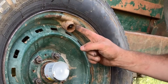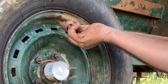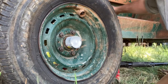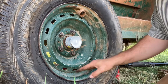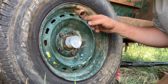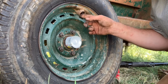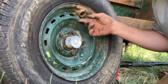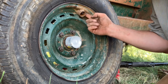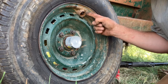You guys seeing this right here? All that is is a nipple, and the valve stem is right there. You're wondering why the valve stem is right there — well, this is something that cattle come up and eat in. They stick their head in here and eat. What they do is step on that valve stem and break it off, and you're always about 300 miles from home it seems like. This little nipple here protects that. You have to carry a screwdriver — sometimes dirt and muck and yuck get stuck in there, but not often. I always have them just weld a little nipple on this, and that will save you a lot of heartache. They should come factory that way — why they don't, I don't know.